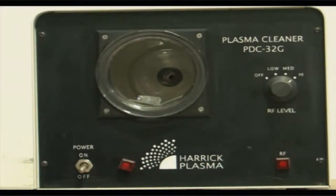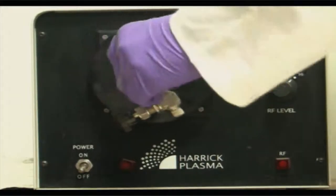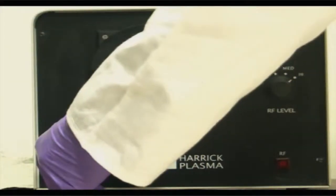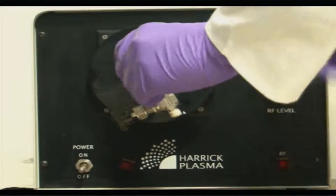And you have a clean glass slide which you are placing with respect to this PDMS piece right here, with the replication on the top, the pattern on the top, and you are exposing it to oxygen plasma because you want to introduce hydrophilicity of the surface so that there is irreversible bonding between one side of the PDMS, the replicated side of the PDMS, and the lower glass plate. Okay, and these are some procedures associated with how the plasma system is operated.